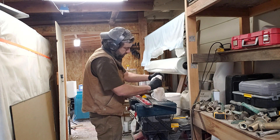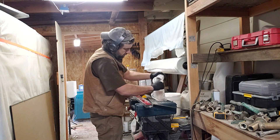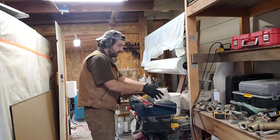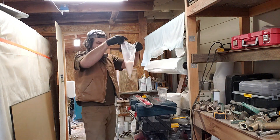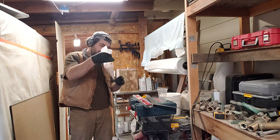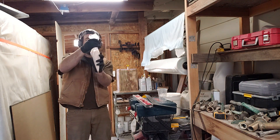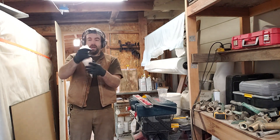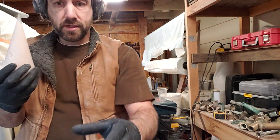I always take a cup, take my piping bag, and do this — that way you get a nice stable base. It's super easy. We could have probably added a little bit more filler, but this is going to do just fine. We'll call this natural peanut butter state. Now take up our little bag — we're going to need more than one of these. Get it down into the tip, start where you don't have any epoxy, and twist. The bigger the wad of epoxy, the quicker it starts to fire off, so we've got to hustle up there and get this done.